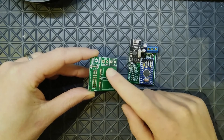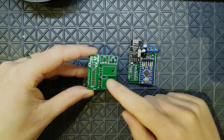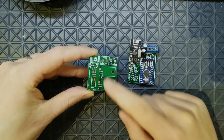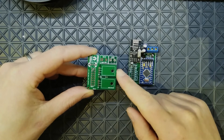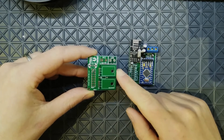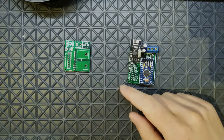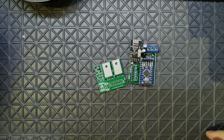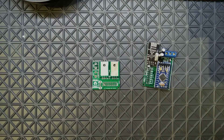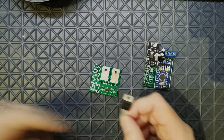In the first revision I actually made a mistake — these parts here were supposed to be bare metal, but I forgot to remove the solder mask. I want the bare metal there to have some sort of heat sink, so I scraped it. I hope I can use that as a heat sink for the MOSFET and voltage regulator, though I may have to add an additional heat sink.